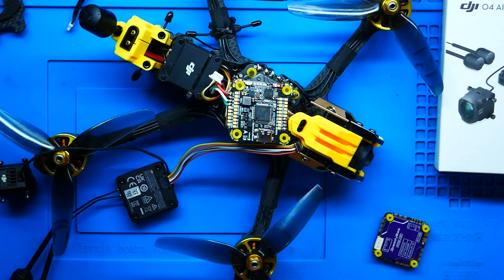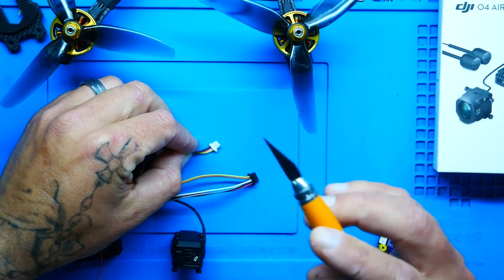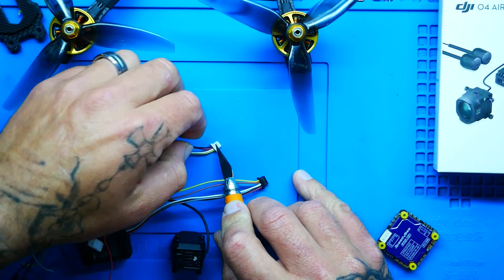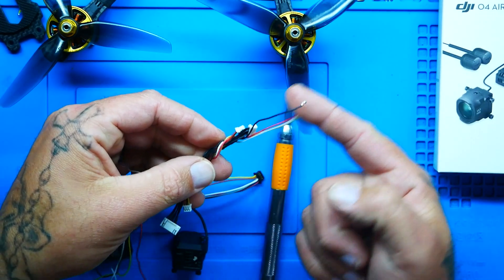One of the questions you need to ask yourself is: are you going to run the DJI radio? If you're going to run the DJI radio, it has to be the new DJI Controller 3 or the previous model, the DJI Controller 2 — those are the only two remotes by DJI that will work with the DJI O4. What you're going to do is de-pin both sides. Hold it up and use a small cutter, putty knife, or tweezer — something small and sharp. Get in there, lift up on that tab, grab the wire, and pull it out. You'll remove the brown and the yellow wire from this connector on both ends, because you won't need those two wires if you're not running the DJI radio. If you are running the DJI radio, be sure to keep those two wires.